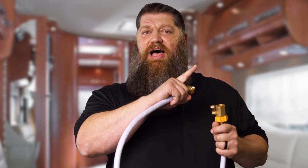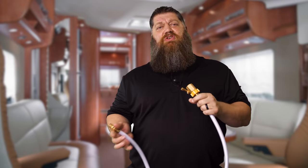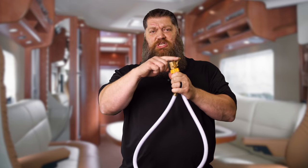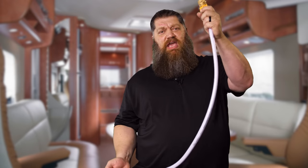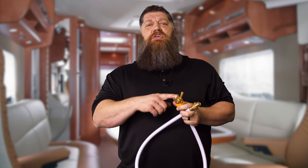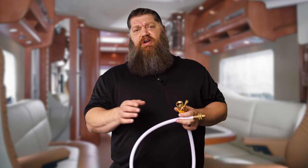This is whenever your tank is empty — remember, we are summerizing. The cool thing about physics is you can actually put vinegar in, and as long as the hose is higher than the tank, gravity takes over and will actually fill that tank up. All we're using the hose for — put a funnel on one side — and slowly pour vinegar in. It will fill up the tank as long as your hose is taller than your tank. Open up your P&T valve and pour in vinegar. If you do two gallons of 30 to 40% vinegar, you can add water. Put two gallons in and let it sit for eight to twelve hours.